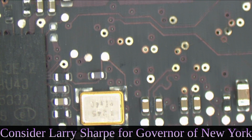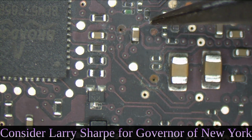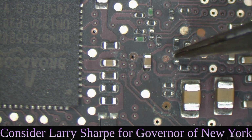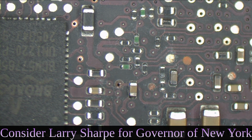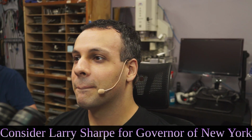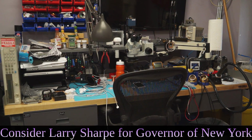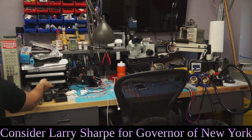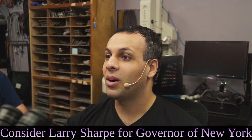And RTC circuit. How's RTC looking? Show me the via for PPV RTC G3 hot. Where system RTC reset, RTC reset L and intruder are pulled up. Destroyed probe point. Destroyed via and probe point. Yep. Come Wednesday, that board's going to be made great again by Paul S.